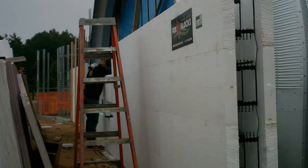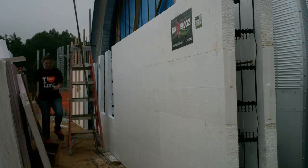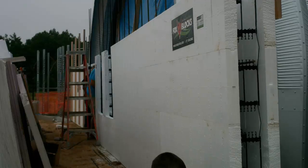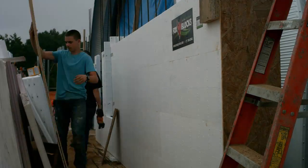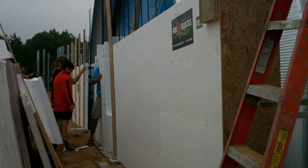More vertical rebar. Here Zack is boarding up the ends so the concrete won't just leak out. For the sides of the windows we use the nicer FOX box. These will keep the concrete nicely insulated around the windows, but we still need to secure those with wood until the concrete sets.